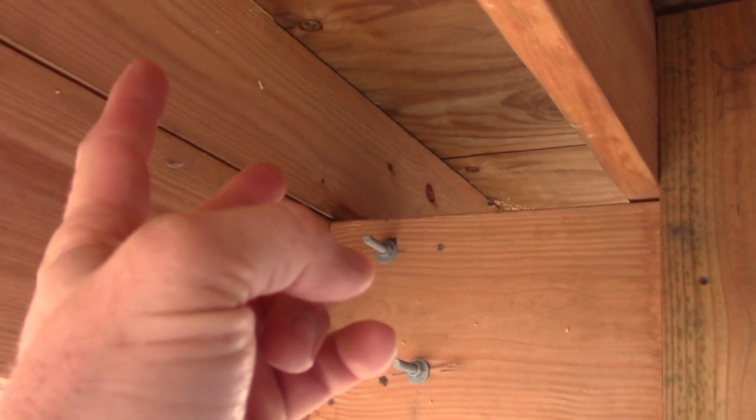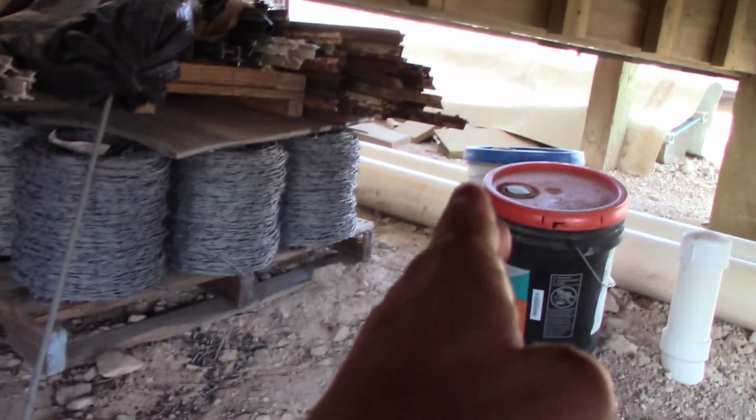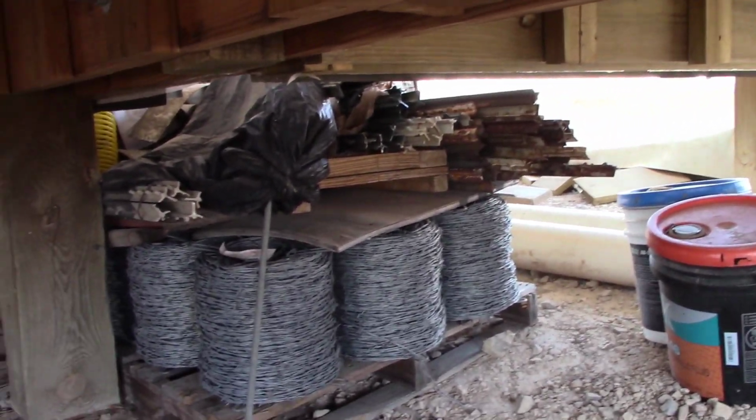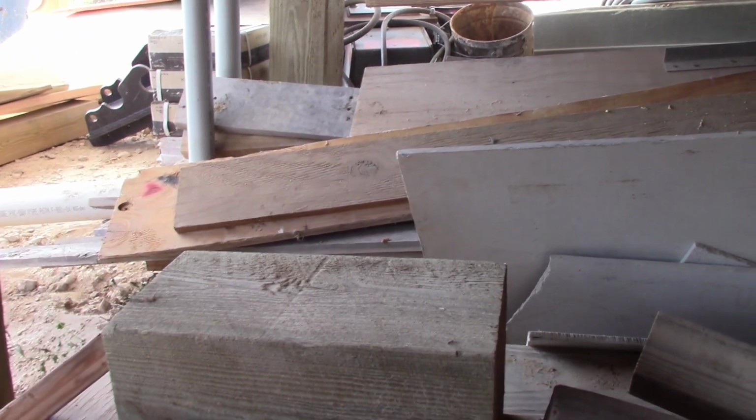Anyway, so on this side, this is the side where the little kitchen sink's going to be. I'm going to have 2 more 2-inch conduits for sleeves for water lines, a hot and a cold. And that's also where I'm going to run my temporary feed for my water off the well. And they'll go that direction towards that little mechanical room as well. And then I've got my little 3-inch pipe here that's catching the waste off the sink, and that's going to run over and turn up pretty close to in line with, just to the side of where this 8x8 is. And I'll have a little grease interceptor underneath here.